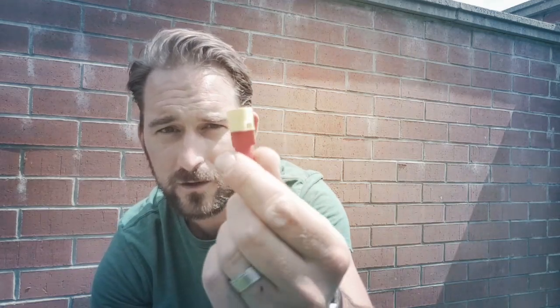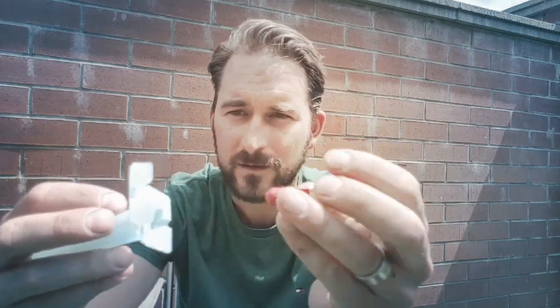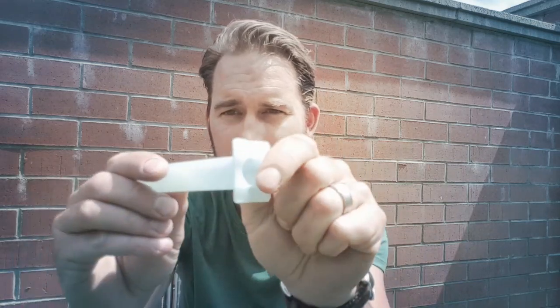The other option, which is a really good one, is probably the most watertight and most pull-resistant. They're a little bit more work, but I would strongly recommend these as well. Basically it's two parts: you get a regular marrette that is not gel filled, but it fits inside a gel-filled tube. It's called a DBRY connection. It opens up, you twist all your wires in here, it slides in, you push it to the very tip into the gel, and then you snap it tight on the wires and you could not pull those wires out no matter how hard you tried. It's a really good option — a little tougher to close sometimes, but they work very well and I'd recommend this over anything at the big box stores.